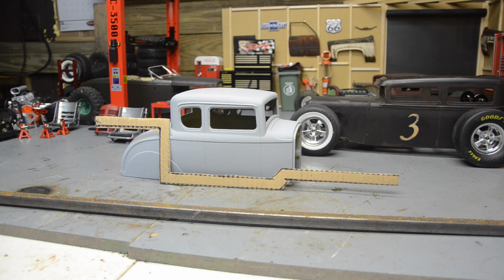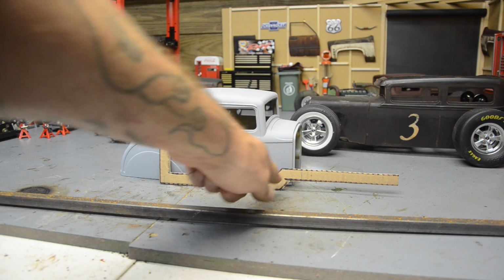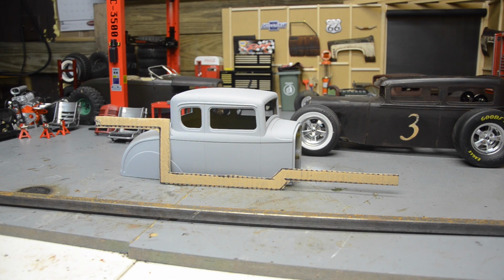And you see I've got a big piece of steel here. And I'm going to do some things different with this. I'm going to do it the same way I did with the solid square tubing. This is 1/2 inch by 4 foot. That's 1/2 inch square, and this is what I've used on my 2 and 3 builds. That way I get two mirror images when I cut it in half. Once I cut the notch and weld, I'll weld it together, and then I'll cut the frame rails in half completely.